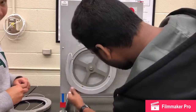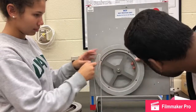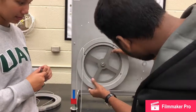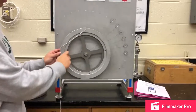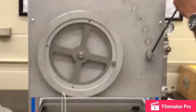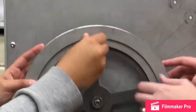The main objectives of this experiment are to observe the relationship between the tensions in the two sides of the belt, to investigate the effect of the angle of lap, to investigate the relationship between the belt tensions and the angle of lap for a flat and V belt, to compare the driving torque for a given angle of lap, to evaluate the differences between the V and flat belt, to determine the coefficient of friction between the pulley and belt for the belt sections, and to verify the belt tension equation with our data taken from the experiment.